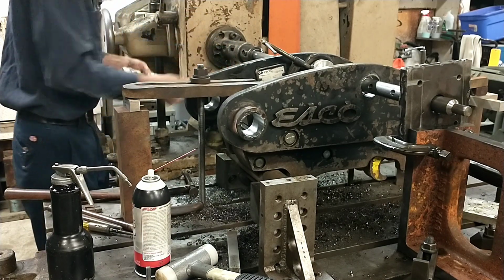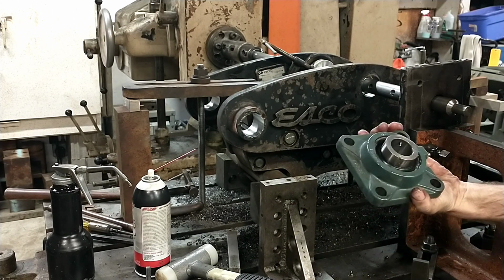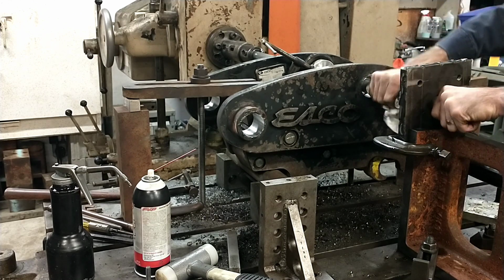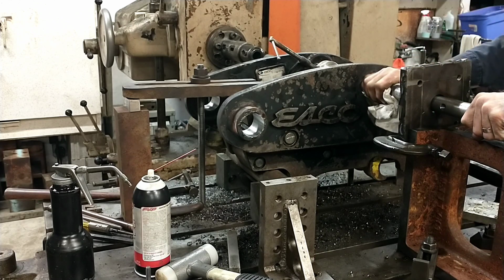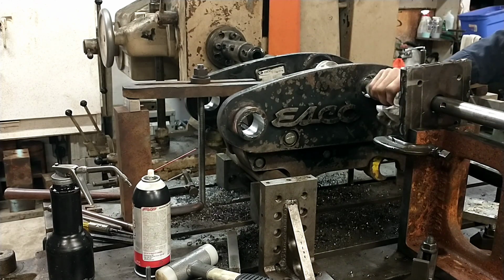Anyways, I just had never happened to encounter them before, so when I was first building my own line boring setup, I was using the, like this one. I had one on here, they're just normal pillow block bearings. I don't know why I thought it was a good idea to grab one of those when I started this the other day, but I keep them around, and I sure don't know what for, because they ain't half as good as these squeeze lock style.